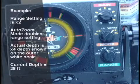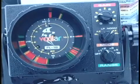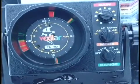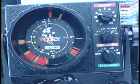The inner yellow scale makes it easier to keep track of your depth. If you have problems figuring out the exact number of feet you are fishing in, just switch back to the normal mode. Adjust the range settings to find the depth you are using on the outer white scale. Then you can switch back into the AZ mode.